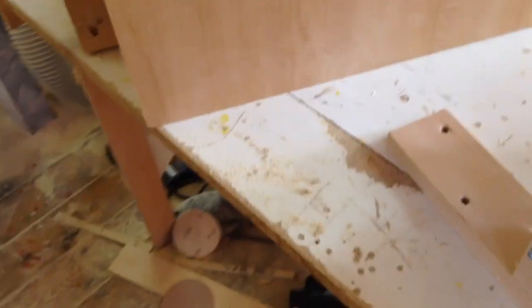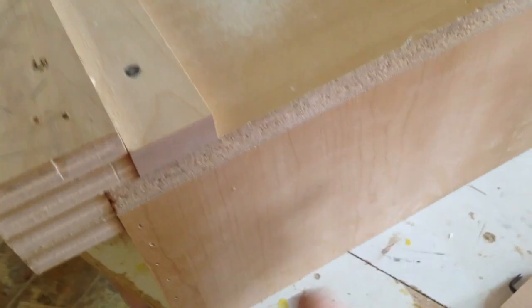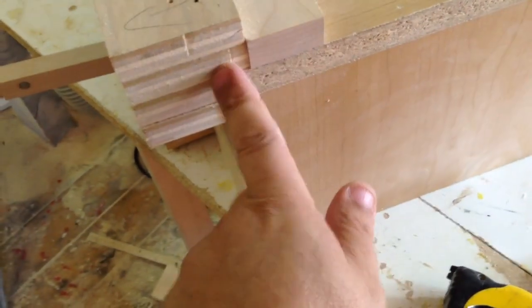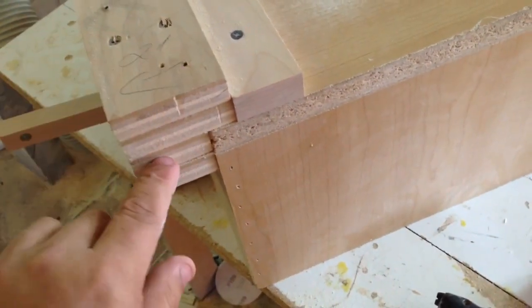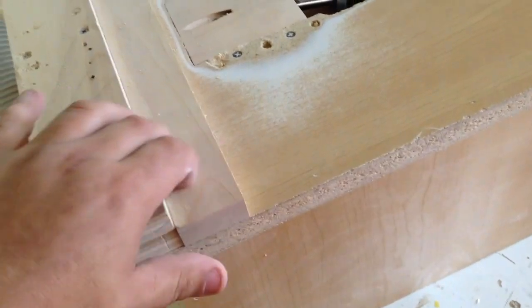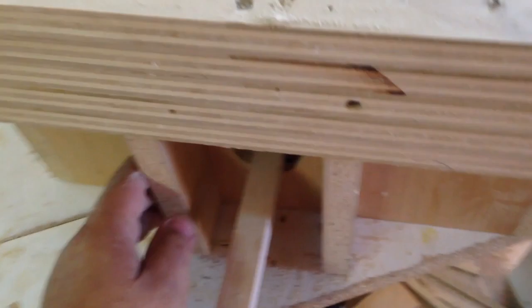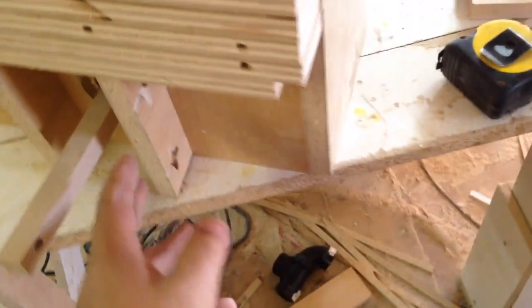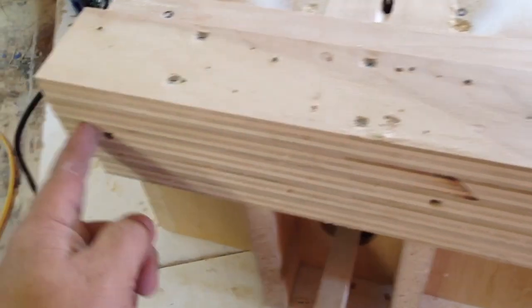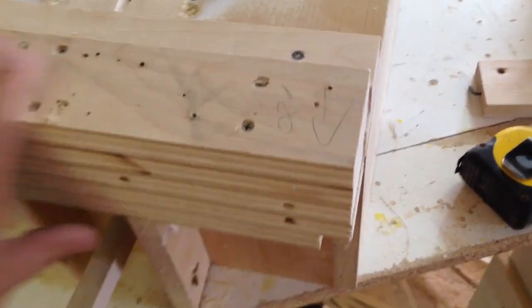This piece is two inches and it's overhanging just a little bit — about three-quarters of an inch overhanging the front of this cabinet. Then I screwed a couple more pieces to it just to build it up some, which allows us to change this little fence here to change the position of the pocket hole. On the back side, I just put a couple of supports on and screwed in through the edge here to hook that on. It doesn't have to be fancy — screwed on is the most important part.